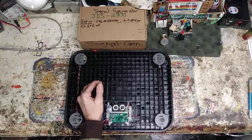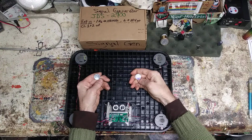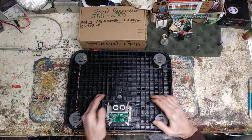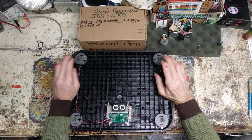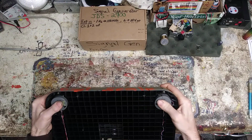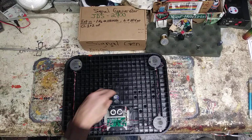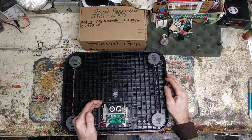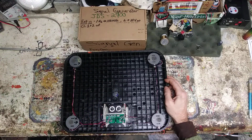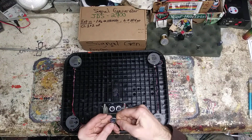This one actually is 5 volt to 8 volt max. It's using 2 3 volt lithium cells, not lithium ion, just lithium cells. And how I know it's not working is because I had it hooked up, and I couldn't get it to work. You hit these 2 back ones, they're actually like buttons. You can see I'm hitting them there, mashing them. What they do is they trigger it to turn on. Well, it wasn't even turning on. I left the batteries in it and forgot about them overnight. I came back and tested the batteries to see if it was drawing, and it drew one down to like 1.6 volts, and it was at 2.9.